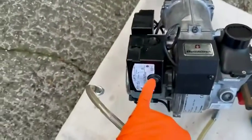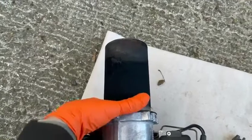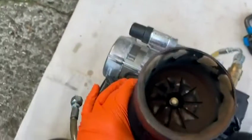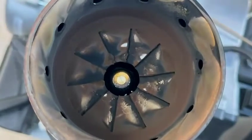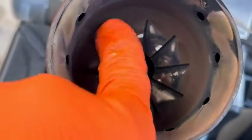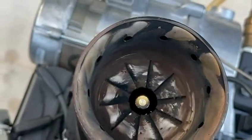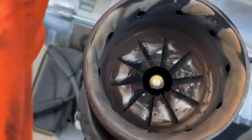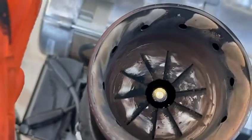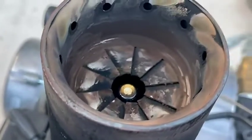As you know, this was flashing green and wasn't giving a solid green light. Looking at it, if we turn it over, you'll see it's dirty. So just here, it's all dirty - look. That basically means it's not producing an effective flame, or something's restricting the flame, and that means the photocell will not read the light correctly - and that's why it locked out. As you can see, that's not the best conditioned nozzle in the world. And I actually think that nozzle is not quite set in the right position, so that's why I think it's done this. I'm going to rip the blast tube off and have a look underneath.